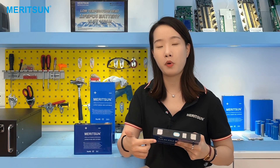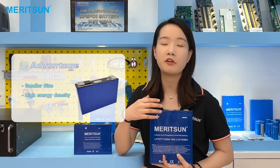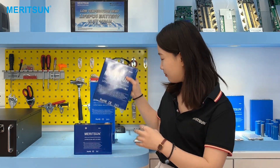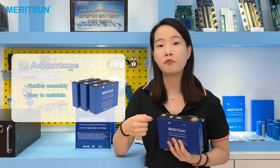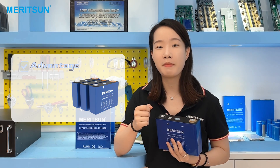There are two main assembly methods for the prismatic cell: welding or screw connection, depending on the cell terminal type. One is the flat-head port, where single cells are connected by resistance welding or laser welding. The battery pack with the flat-head port is smaller in size and has high volumetric energy density, but it is not easy to disassemble or replace cells in after-sales service.